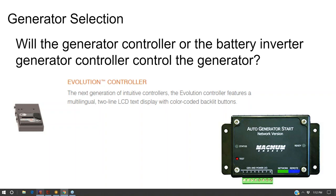And that's not the only way you can wire these things. You can actually wire these battery inverters to support the generator such that the generator provides the base load and the solar battery provides power surges, which are hard on generators. So you can kind of improve the fuel efficiency of the generator using the battery inverter in what's called a generator assist mode.